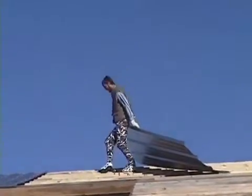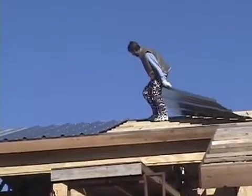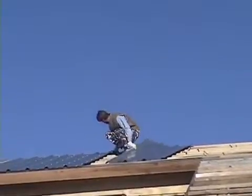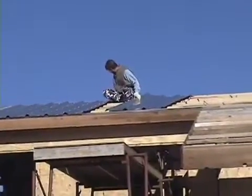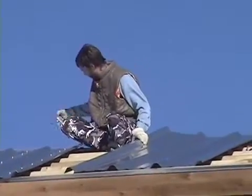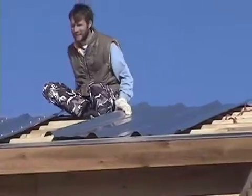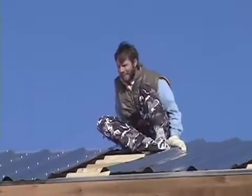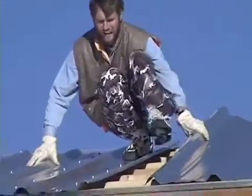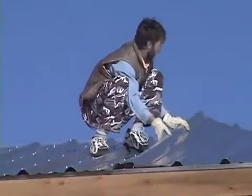A little word about my roof while I'm showing it here. Under the eaves, I didn't do anything fancy to box them in. I just ran the rafters straight off the edge of the walls, capped the ends with treated 2x6, and then after the treated 2x6, 1x8 cedar. And that worked really nice to conceal the vinyl siding that I put in underneath the eaves. The trim for all that fit right behind the 1x8.